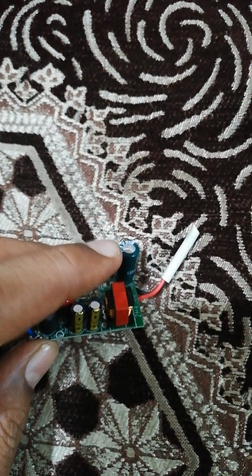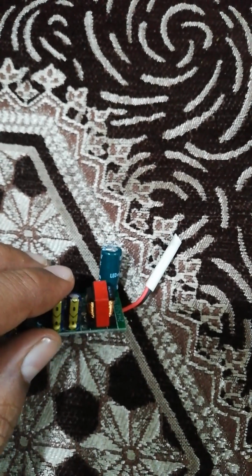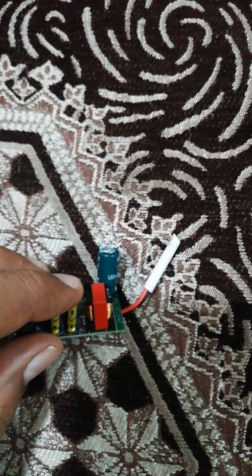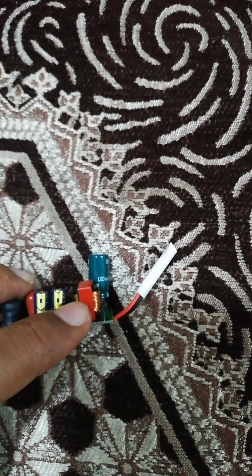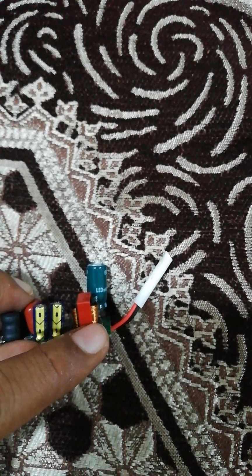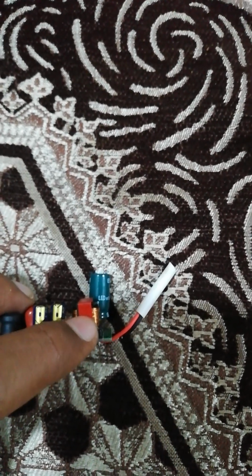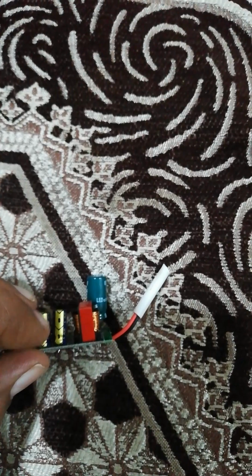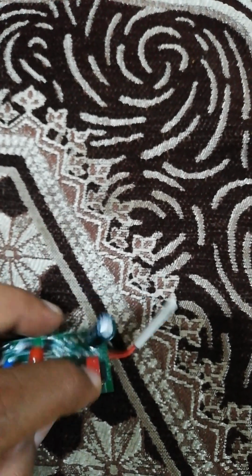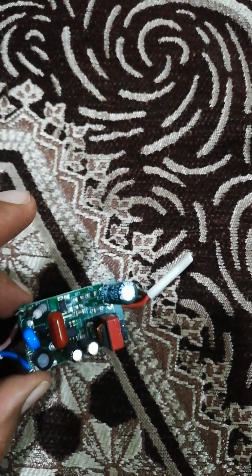The primary job of the transformer is based on the electromagnetic induction principle, where you apply an electric field in the primary, and the current due to the applied electric field will flow through the coil, that will induce a magnetic flux in the coil. In the secondary winding or secondary section of this transformer, that varying magnetic flux will create an electric field in the secondary side. So it's a kind of step up or step down depending on the transformer. You will have the electric voltage at the secondary. Okay, so this is an electromagnetic based principle.